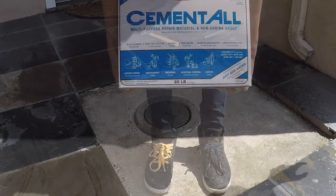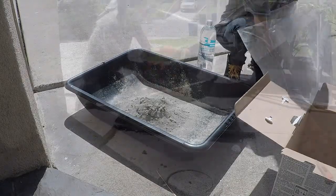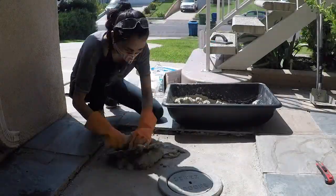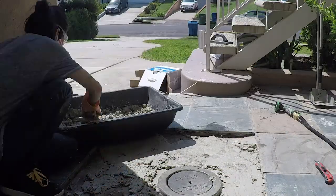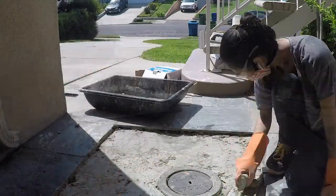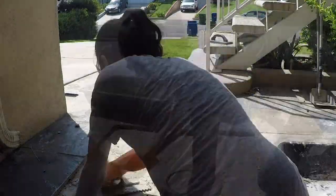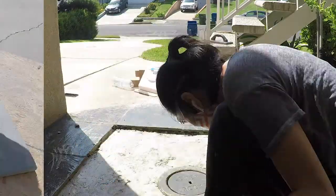Okay, so now that that's all done, I took my cement and created my cement mix so that I could raise the layer of the foundation. The foundation was a little too low, and when I put the tiles on top, it sank in a little bit, and I didn't want to have to use a really thick set of thin set, so the layer of concrete helped raise that up. Again, no idea if I'm doing this right.